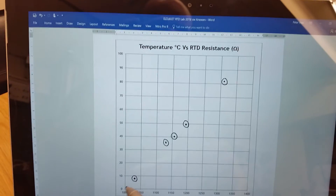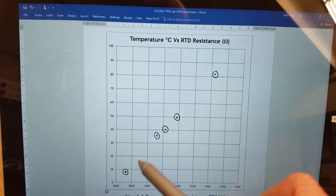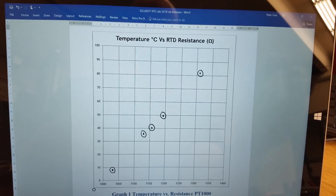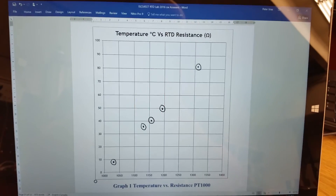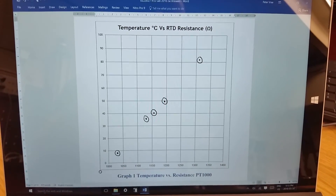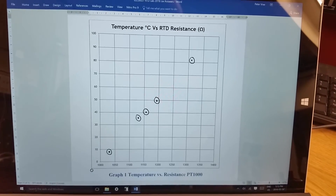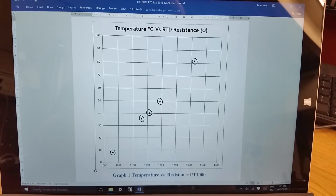The last thing to do is plot these values out. Once I plotted my resistance values on one axis and the corresponding temperature readings in degrees Celsius on the other, you can see it's actually a nice linear increase in resistance going up from the ice water through samples two, three, four, and finally the hot water. Thanks for your patience — you can see that the RTD is simply a piece of platinum wire that as you heat it up gives an increase in resistance, and using that chart we can get a pretty accurate temperature reading of whatever medium we're measuring.